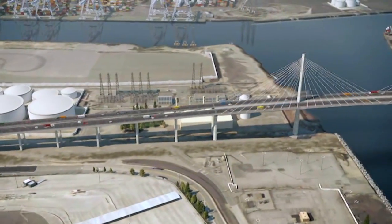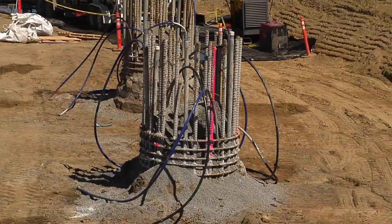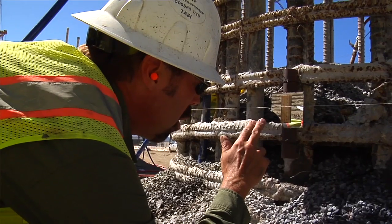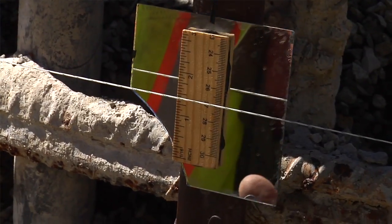For the bridge to be functional through its entire 100-year useful life, the foundation has to be very stable, and these piles need to be very stable as well. In fact, we can have little to no movement downward — no slippage or settlement of these piles.